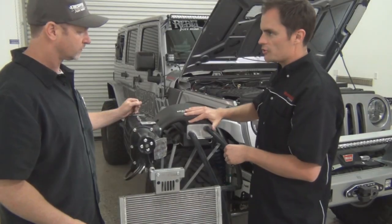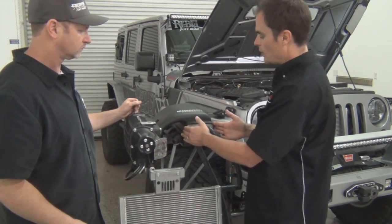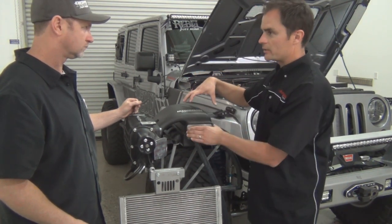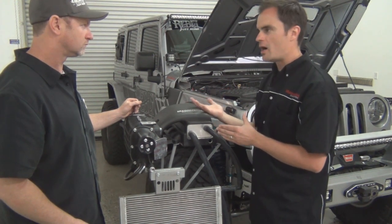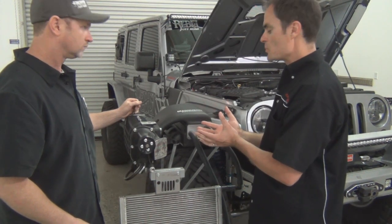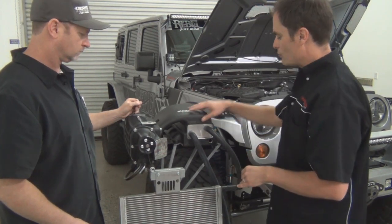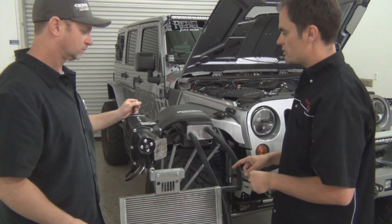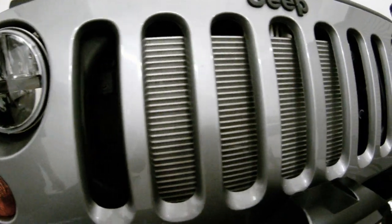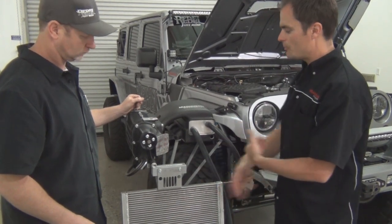Now, every one of our kits is also water-to-air intercooled, so the intercooler brick actually sits right here in the manifold. Now on the 3.6 kit, where the blower unit sits on top, the intercooler brick sits directly underneath. It's a bit of a myth that superchargers run hot. An Eaton TVS actually doesn't, because it's not compressing the air inside the supercharger. It's actually compressing once it gets into the manifold. But the more you cool the charge, the more power you make. So it runs its own completely separate intercooler system. It has a separate reservoir and pump that runs coolant. And we run what's called a low temp radiator, or some people call a heat exchanger, out in front of the vehicle. That's where it gets fresh cold air, and it's helping this intercooler work.